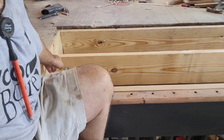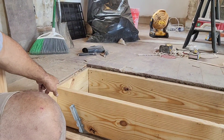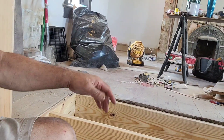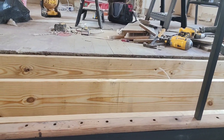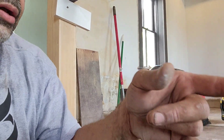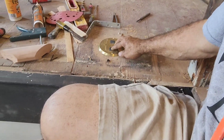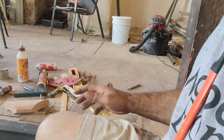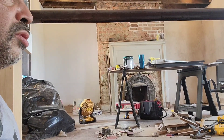We've got the 16-on-center framing with a two-by-ten, put the joist hanger on here, got this cross nailed between the two of them, and then we can start putting the floorboards back on. You can see it's even across there so it'll line up our pieces of flooring much better. We're gonna put this to bed - Michael needs to put in the electrical box for our floor outlets. We actually have power: if we have a couch here we'll put power right here, and one in the opposite corner as well, so it'll cover anything we want - phone charger or a couch that needs to plug in.